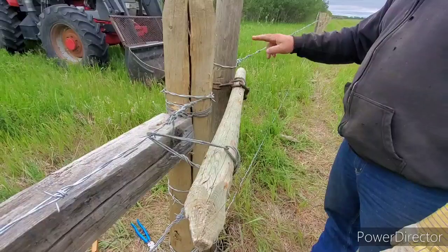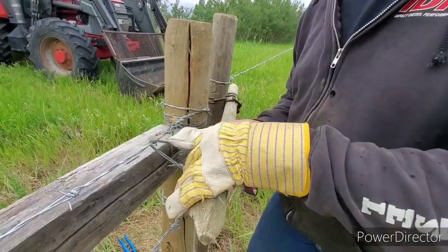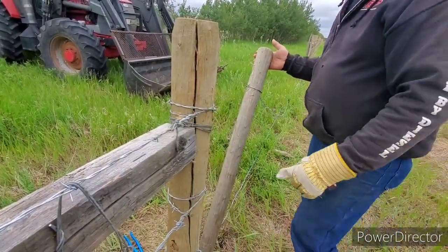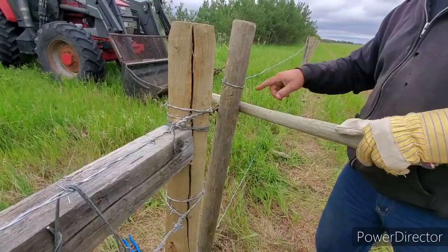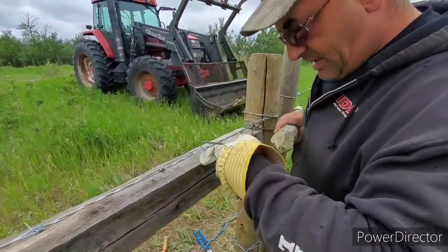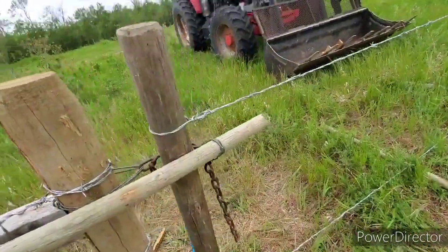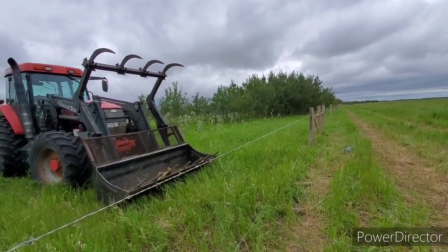We put the fence stretcher on here, and I put the fence stretcher on the bottom. And now this is tight. I hope it's not too tight for the wife. But you just lean against that post, flip that off, and that's all there is to opening your gate. When you tie your gate, your post tie, you bring it in just below the top wire. And you put some pressure on that sucker, and there it'd be, like so. Okay, we gotta get our number 3 and our number 2 wires run, and then attach a couple of posts to those. We'll come back in a bit.